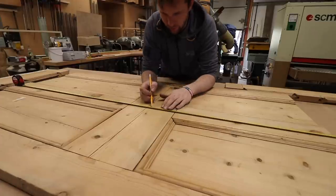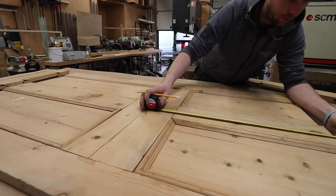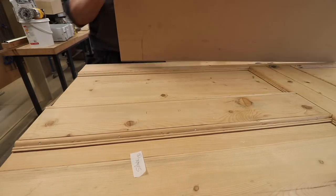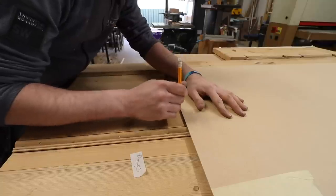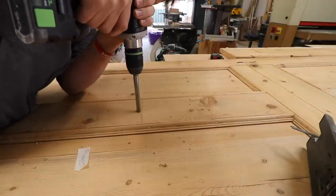So now the doors are cut down, I'm just setting out from the centre of the middle rail the height of the shutters so that the middle rail and the finished shutters ends up in the middle. And then I've checked the timber thicknesses for the top and the bottom rails and I've done the appropriate sizes in from their marks and used a square cut board working from the inside of the door stiles to square over my shoulder line on them mounting rails.